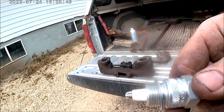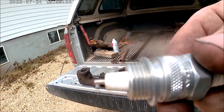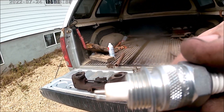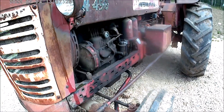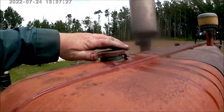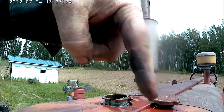That switch is for the carburetor. There are no adjusting screws on these carburetors — you get what you get. Here are the spark plugs — they're special long-reach plugs; you can't use anything else. IH recommends changing them out every time you rebuild the engine, so you don't change these often, and they don't give much trouble.